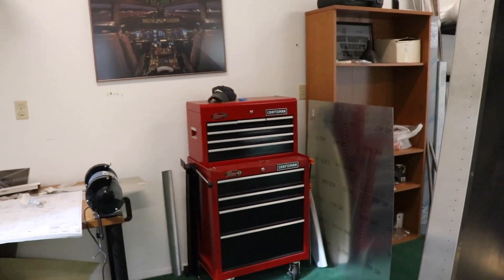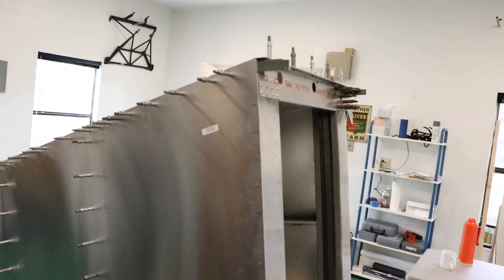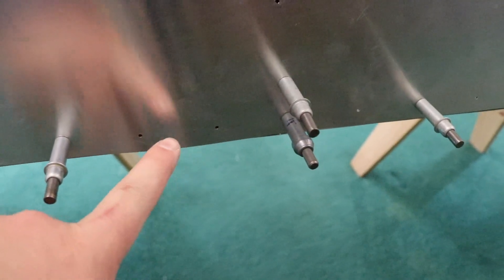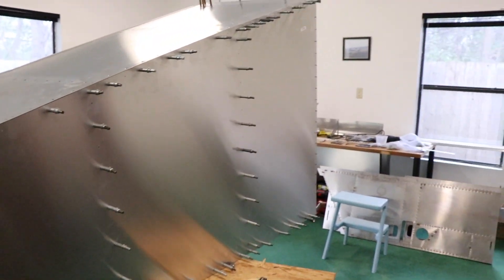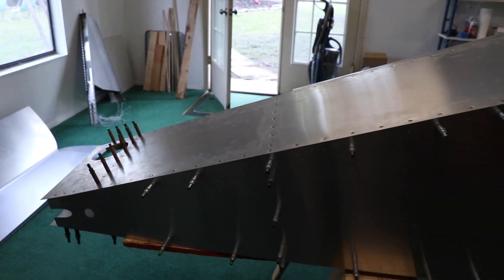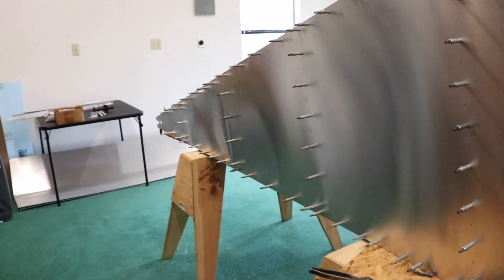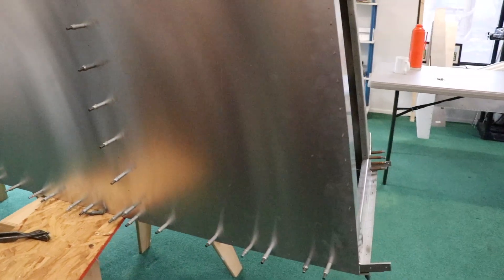I've been on it for about two hours and I'm going to take a quick break. I've been going piece by piece trying to make sure all the bows are out of the aluminum — I have most of them out, there's one small one left. Remember, these ones have already been pre-drilled; I'm really just trying to get these through the longerons, which is that big piece of aluminum angle iron. Then I'll drill it up to the larger size and countersink and dimple die — all the good stuff. I'm not going to rivet at this point because I have to put a bunch of other pieces inside. They suggest not doing it until the last minute because you have to rig all the controls and run all the rods through, and I still have one or two little things to do inside as well.